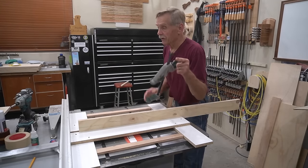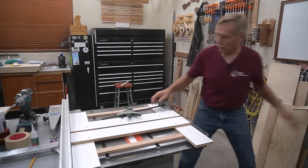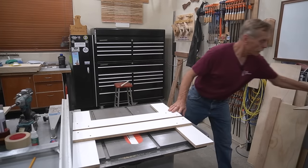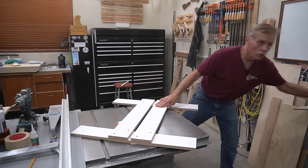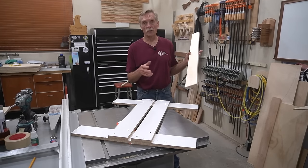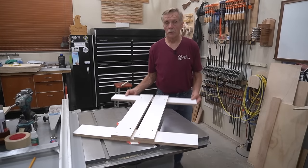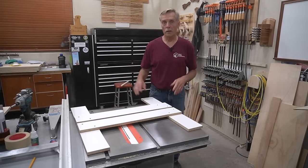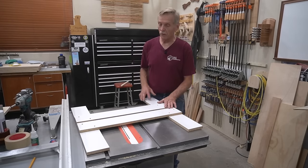Even though it takes time to demonstrate the setup and building of this fixture in the video, without the camera rolling it takes less than five minutes to make a fixture that's specifically sized for a specific material — making it my go-to method rather than spending time creating an adjustable fixture. It's much simpler to get another piece of scrap, build another fixture of the right width and length for the project, and then send that scrap back to the bin.